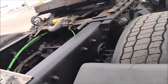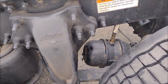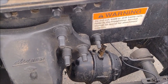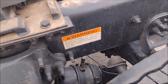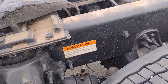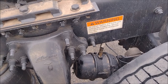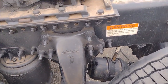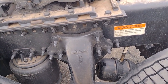This one is sealed — I got three sealed, one is not — so I will have to get a hammer and push that rubber plug into the hole to prevent this drum from failing on me. If this drum fails, especially if you leave the truck for a few days, you can have a frozen air drum on the brakes. When you start the truck and apply air to the emergency brake, you can suddenly get a ruptured diaphragm.